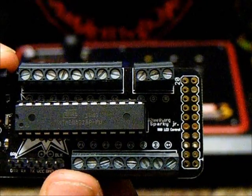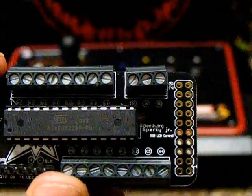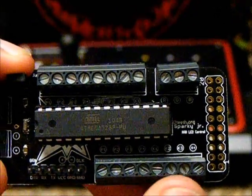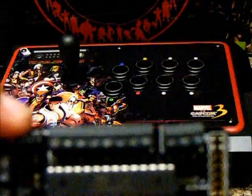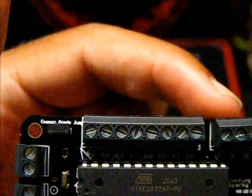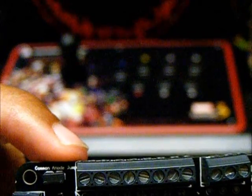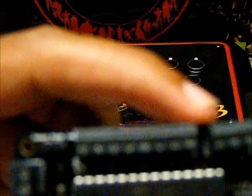Here are your various button signal inputs — this is what you would wire your button signals to. So whenever you hit a button, that wire goes here. These ground wires, as you see here, are labeled accordingly and are coming from your ArcEye version 2. You'll have one black wire that is given in the kit and you just wire them up here.